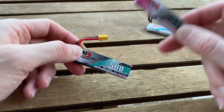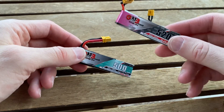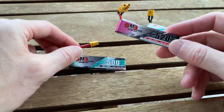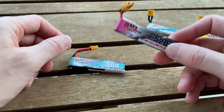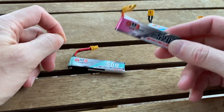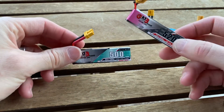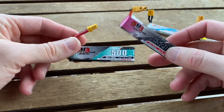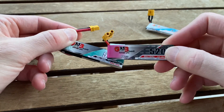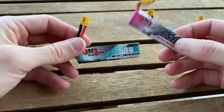It's really hard to get the testing absolutely consistent, but basically, if you didn't charge this to HiVolt, this cell started to struggle to get through the test — it was dipping down pretty low. I think it got down to 3.12V, maybe even the lowest of all the batteries I've tested. And then the voltage at the end was essentially the same between the HiVolt and the LiPo.